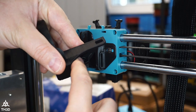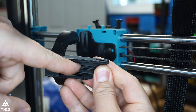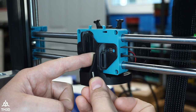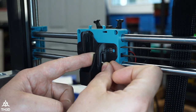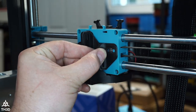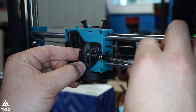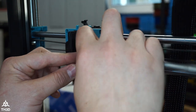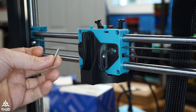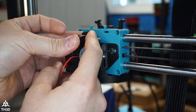On the fan duct, go ahead and drop the M3 nut into the nut capture on the inside of the bracket. Put your finger over the nut and put it up into the bracket. Take the M3 by 12 screw with one washer and put it through the hole into the nut — you should be able to feel the nut move when you push the screw through. Then take your 5015 fan and the M4 bolt, put the fan into the mount, and put it through both the mount and the duct. Take the M4 nut and put it on the bolt.